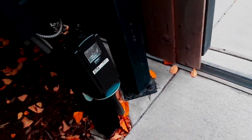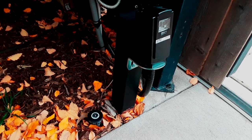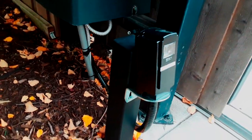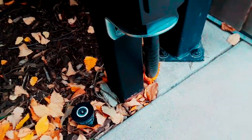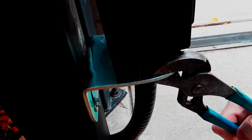She said she had some vendors at her house doing something for a long period of time, and it's pretty obvious that the bracket got bent — and that takes a lot to bend. I'm going to take my channel locks and bend it back down, and I can already hear that the photo eye came into alignment and then back out, so there's still tension on there.